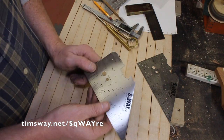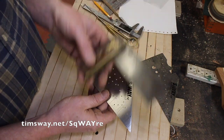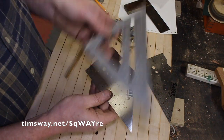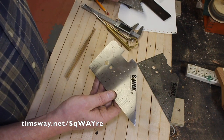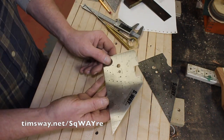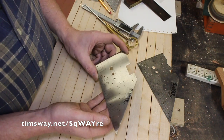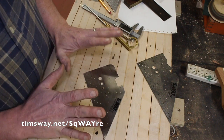The square is a multi-tool. It's primarily a layout and measuring tool. It does not replace this square and it does not replace this square. It's a tool you can grab instead of those sometimes, but those are still pretty important and they have differences — the main one being that they have a lip on them. I end up using this as a simple ruler for laying stuff out most of the time. That's where I find its primary value. I have it with me everywhere I go.